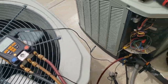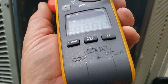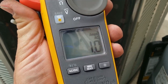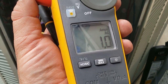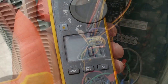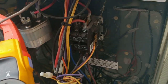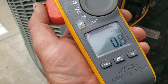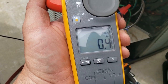While we're waiting, let's recheck the amperage. Still at one amp — right at our max. Now for comparison, let's recheck this capacitor. We're at 0.7 amps — about the same as before. I pulled away from the contact because a magnetic field on some meters can really skew the reading. Now we're at 0.8 amps.